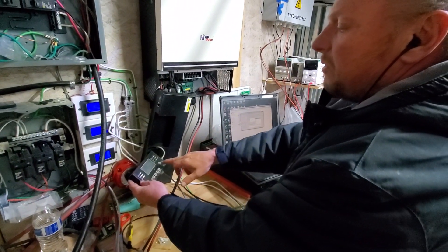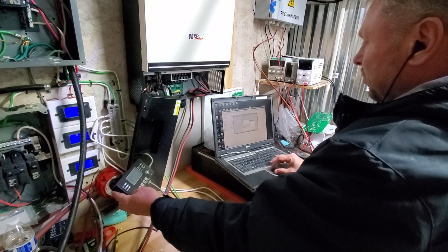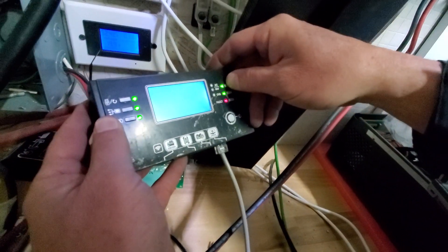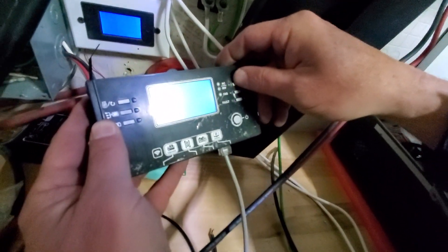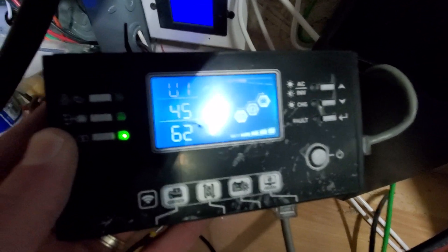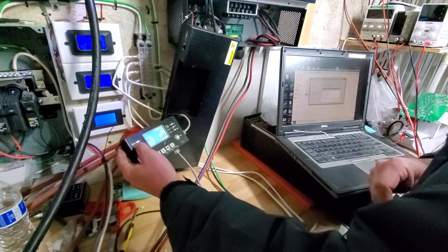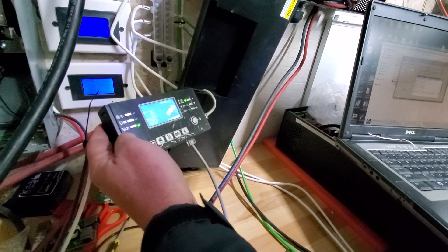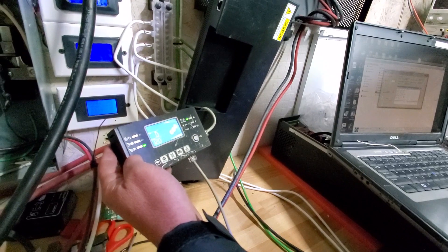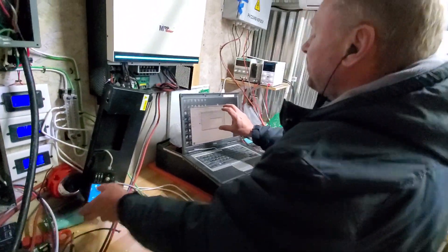Because the inverter was on battery only and the power switch was off after it finished, it beeped and showed 'Update Success.' Turning this on for the first time after the firmware update — the firmware version is now 45.62. Inverter still works and still operates normally. Just remember: if you flash the wrong firmware — you cannot take MPP Solar firmware and flash it on a Sun Gold, EG4, or similar — it's just going to break it. MPP Solar now has a solution to make the inverter less sensitive to generator noise.